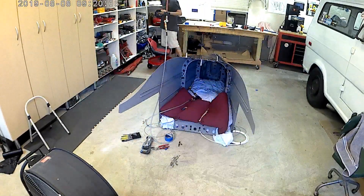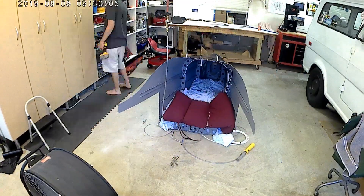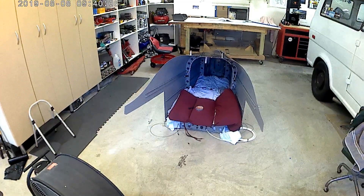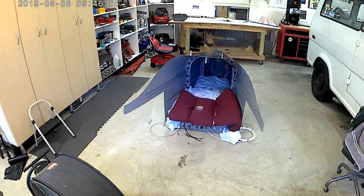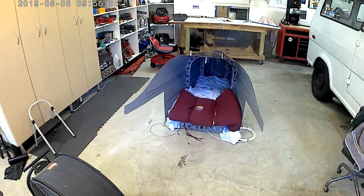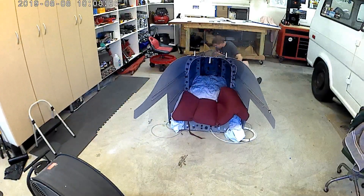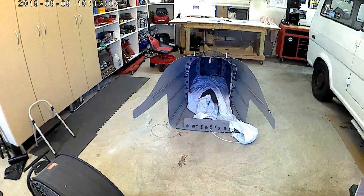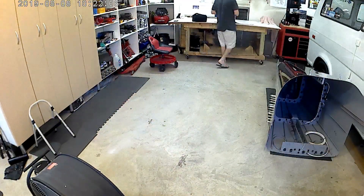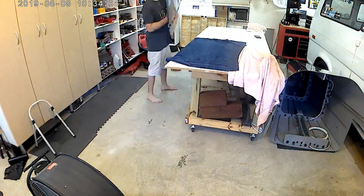Here at the top where the center spar meets the most forward rib — that's a particularly hard one-man job no matter how you split it. I highly suggest putting a little painter's tape over the dome head of the rivet; it made the rivet still look relatively new and clean. That was tough. And then just a little bit of tidying up — that's it for the tailcone. We'll see everybody for the empennage attach section for the horizontal stabilizer and the vertical stabilizer. Take care.